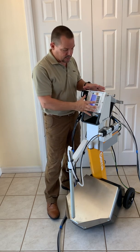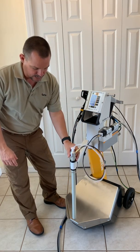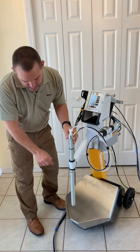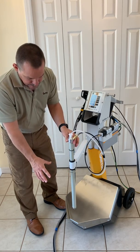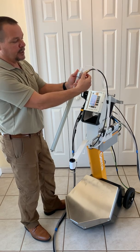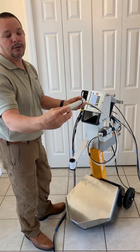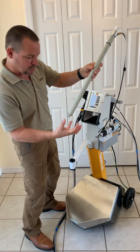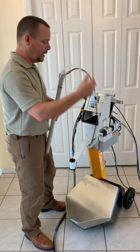Moving down through the rest of the system, we'll come to the pickup tube assembly. We have height control so we can control where we want to be inside the box — all the way down or in the middle. The pickup tube pulls completely out, and a small amount of compressed air comes into it, down through the tube and out through this fluidization ring. It fluidizes a small area around the pickup tube, allowing good consistent delivery coming up the tube and out through the pump.